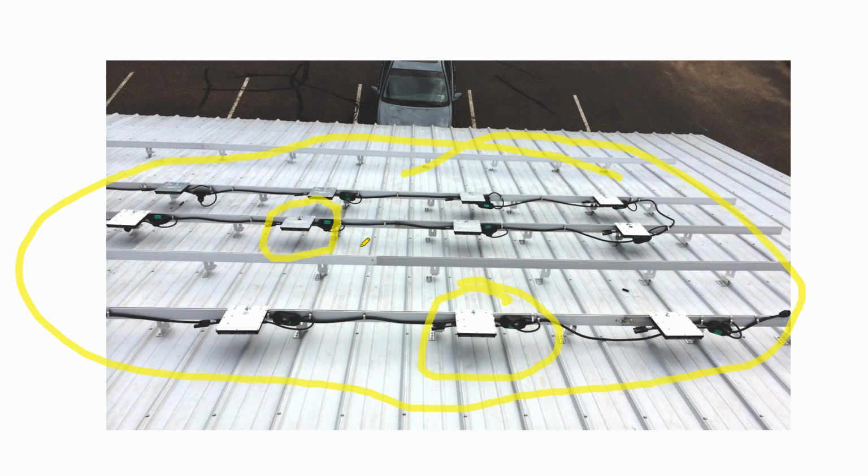And I have made those arguments in past solar programs of years past. But as I get more into aging solar arrays, what happens is, out of all of your racking, modules, and inverters, the inverter is the number one component that is going to fail out of those three. And so if this microinverter were to fail, and now we have solar modules on top of it. So here's a solar module, here's a solar module. I guess one of the rails is not pictured.